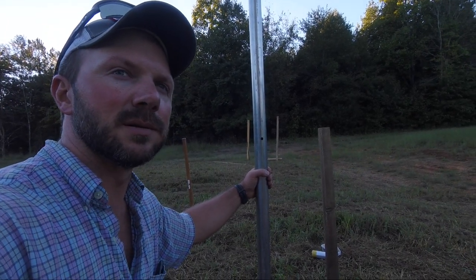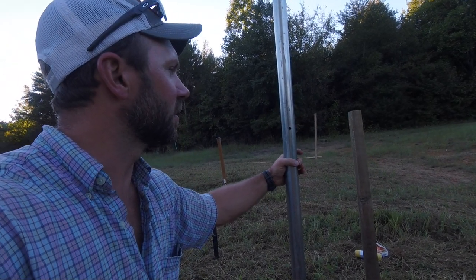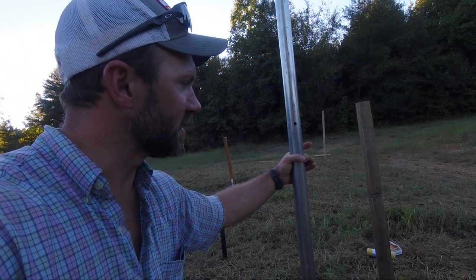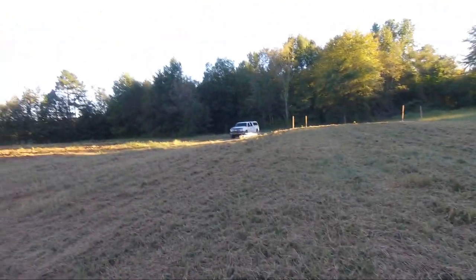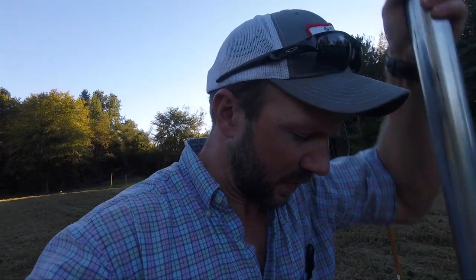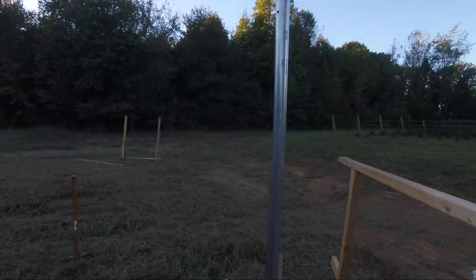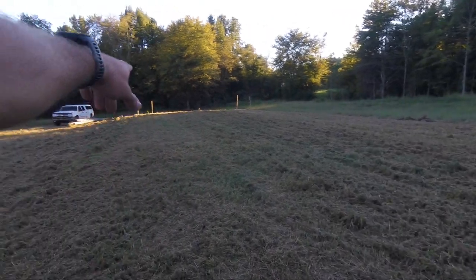Lumber's come down now so I'm thinking about using two by tens, but if you go two by tens you've got four and a half inches below that, so you're looking at putting her in the ground about two feet down. There's a little bit of fall on this pad — that's intentional because I don't want the water to stand in here. I want it to run out the front. So you can see how much post will be driven in the ground, and it'll get gradually less as we go down to the end.